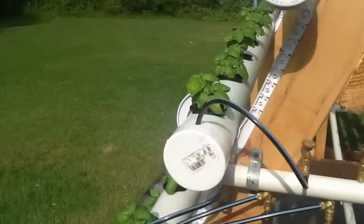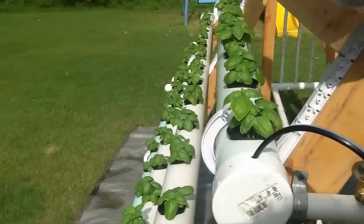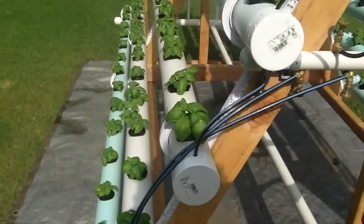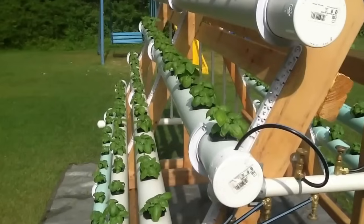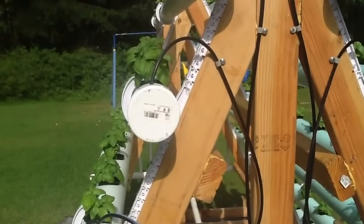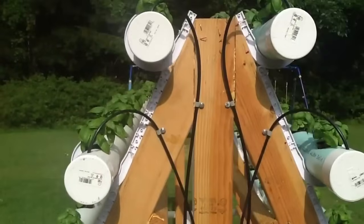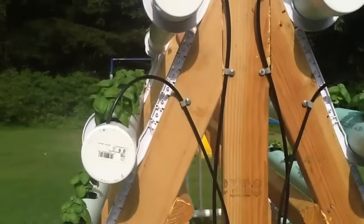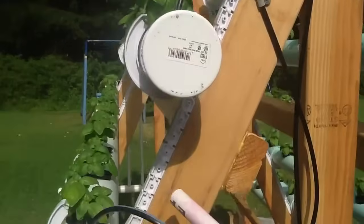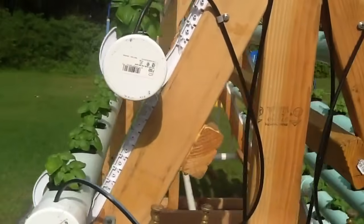I've got the water coming out here. These are 3-inch sewer and drain pipe, which means it's a lighter schedule PVC than your normal PVC pipe — a lot easier to cut, and they're a little cheaper. Caps are cheaper too. I also use these brackets, which are really nice because once you set your top ones level, you can just go ahead and put your next ones right up against the bottom, so you don't have to keep leveling off every time you put a new pipe on.